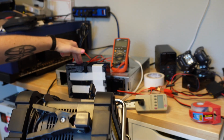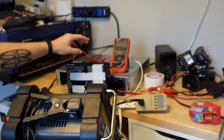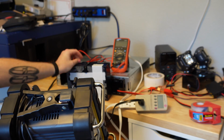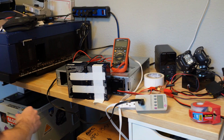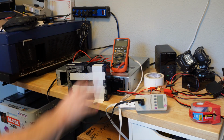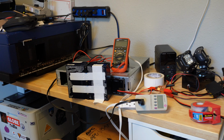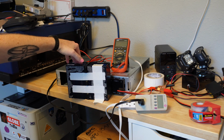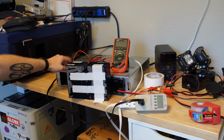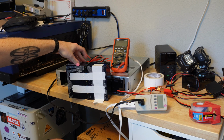I think on the side of these, they say up to 14.7 volts or 14.5, something like that. But you cannot float them at that voltage. So you have to have some way of detecting when they're almost done charging and then switching over to a lower float voltage, which this does. And my bench power supply, not actually being a battery charger, doesn't. The annoying thing is that it only floats them at 12.7 volts, which is pretty normal for car batteries, but is low for a UPS that usually tries to get more charge depth out of these.